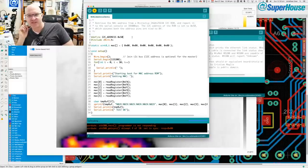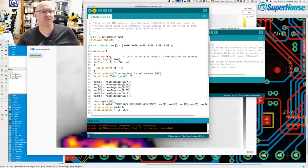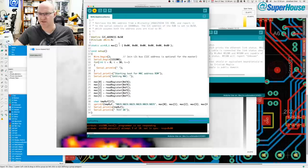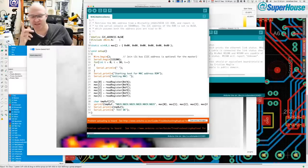All right, so we diagnosed the power supply problem, and I think that that is probably okay. So this problem with uploading a sketch to it is probably related to the 16U2 USB to serial chip. Okay, I'm not going to do this now on the live stream. I need to finish this and go and have lunch.